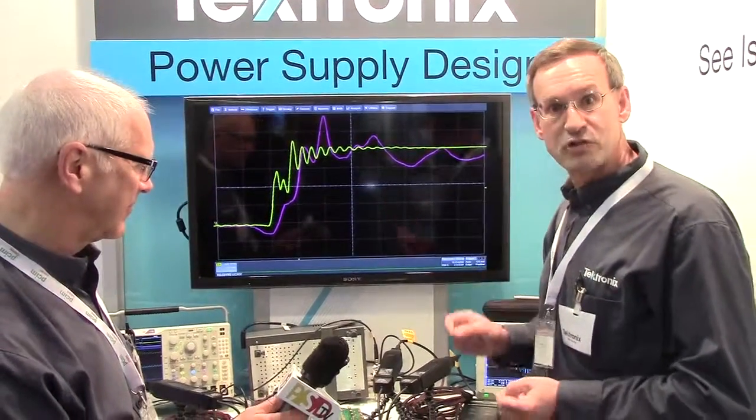One of the goals of the ISOVUE system was to maintain signal integrity down the differential signal and eliminate the EMI effects. With traditional probes, those wires hanging out all over your circuit pick up all the other garbage around it. ISOVUE shields all the way down to the test point and gives you the accurate differential measurement.